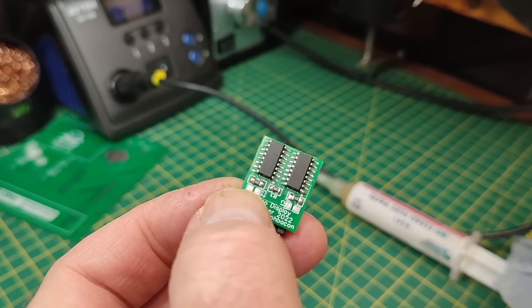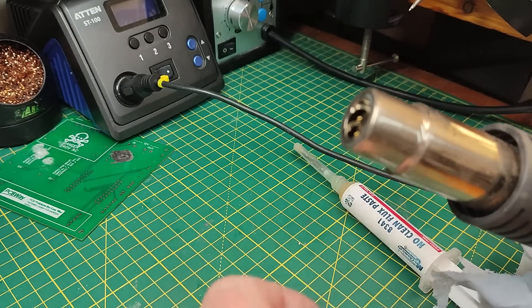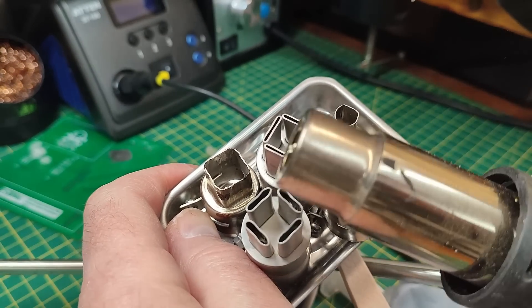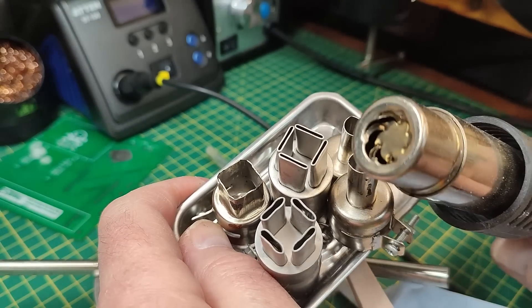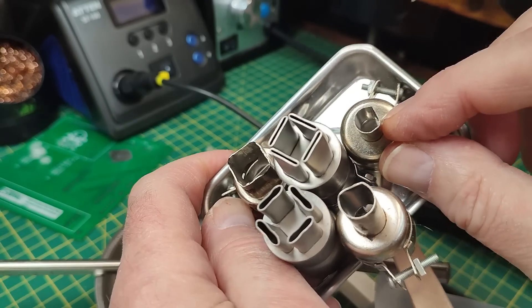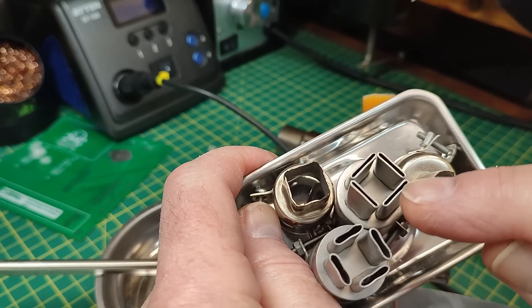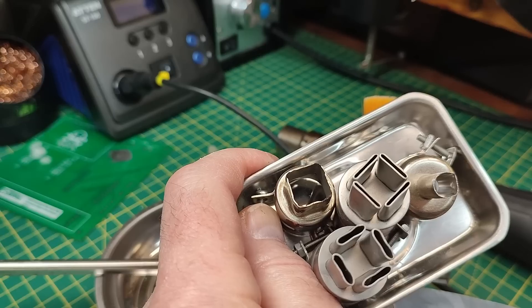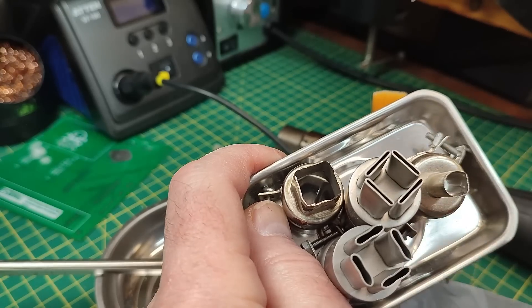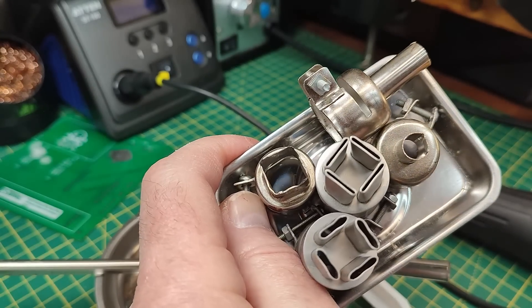You could use a heat gun, and I have one here with a gazillion nozzles. Some nozzles target the hot air to the right place, and others only let air out through tiny slits — ideal for quad flat pack. There's a bigger one too, and one that just blows hot air in the middle. They work reasonably well, but I think there's a better way.